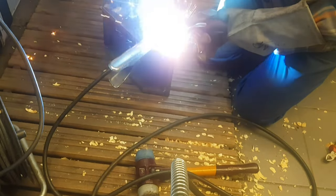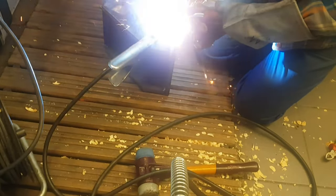The only exception was the top plate. It will later be screwed in position. I only tack welded it here because it acts as a reference surface for the other 3 plates. That way I can come close to a 90 degree angle between the mounting plate and the top plate. This angle is critical because later when everything will be mounted on the mill, the XY table would be higher or lower on one of its sides. This would lead to problems when making accurate parts.